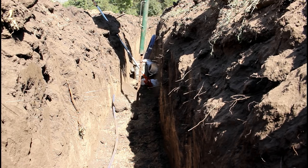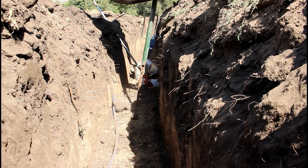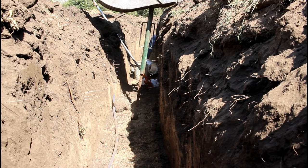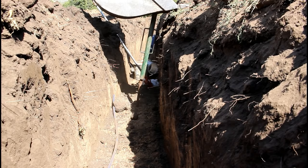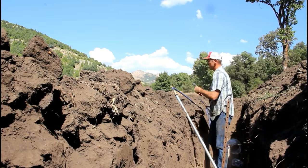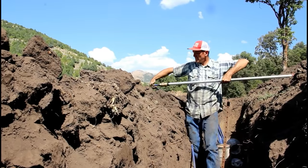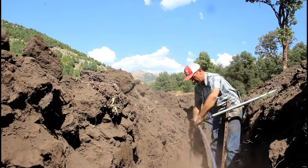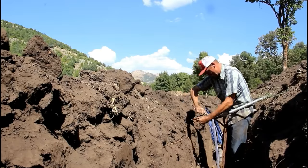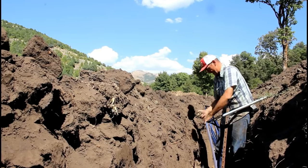This is what's called a three-foot bury hydrant. I put it a little bit deeper than it needs to be but after the dirt settles it should be perfect. The three-foot bury depth is subject to the code in our area — we have about a 30 inch frost level. Woodford makes hydrants for just about any and all frost depths.